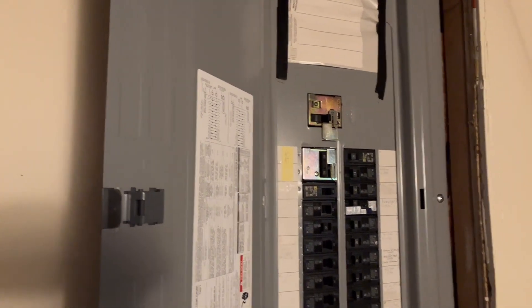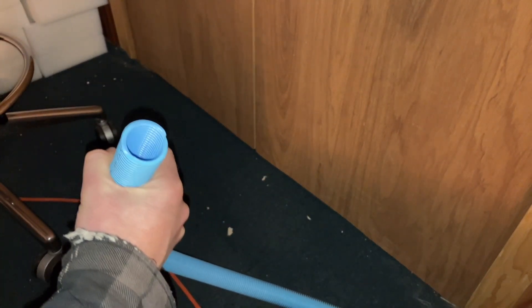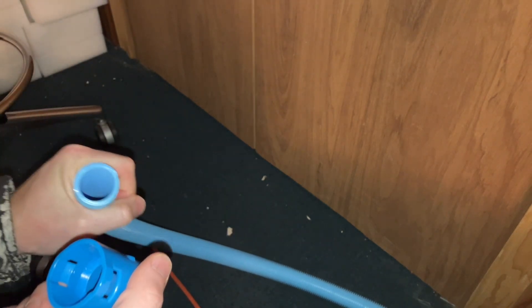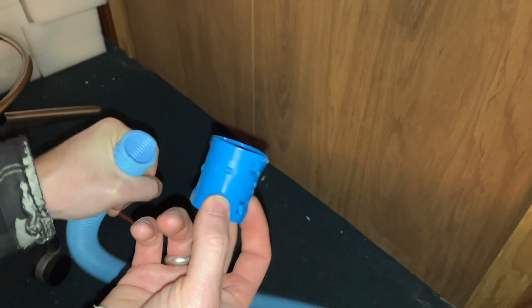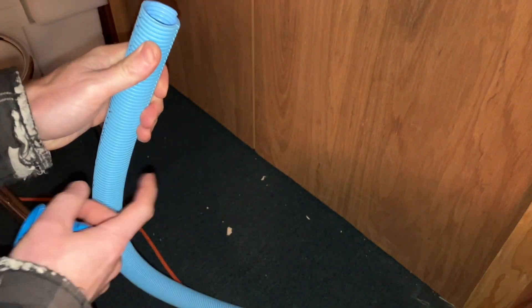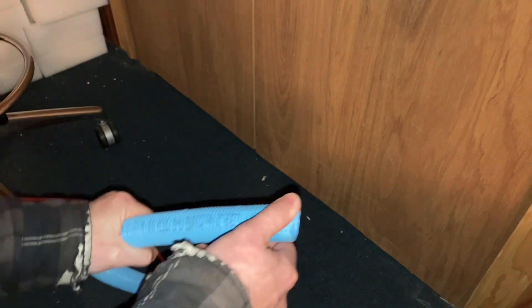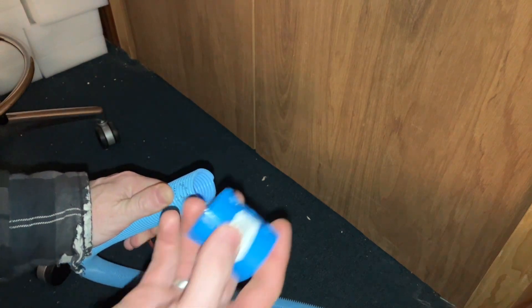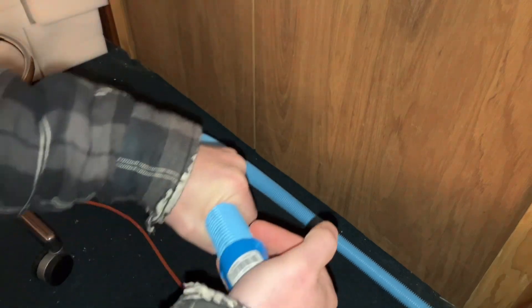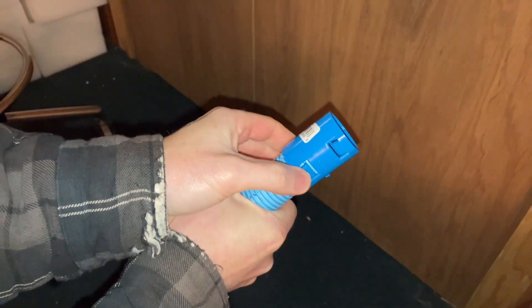Fifty bucks can save your hardware. The reason I'm going with this ENT conduit - I know a lot of people are using liquid tight, but that stuff gets to be very expensive, especially when you start looking at the fittings. These are a couple of bucks per fitting, maybe a buck and a half. I don't remember how much the conduit was, but this is one inch. You can see I can put a good bend in it if I need to. I haven't yet tried applying heat for excessive bends, but I think it should give me the ability to take almost any form I need. To add my coupler, just slide it right over the end and give it a good push until you hear a few clicks, and you can see that it's locked in.